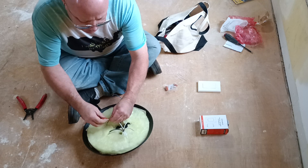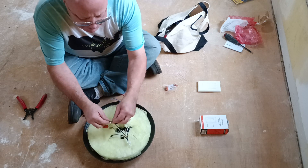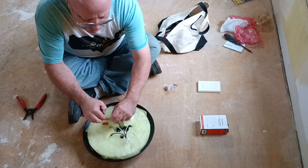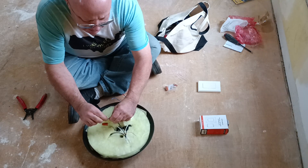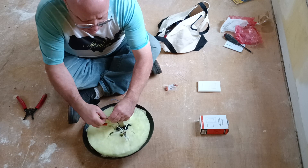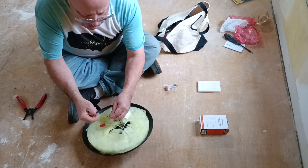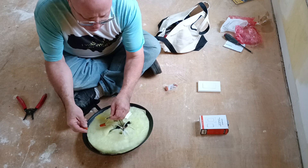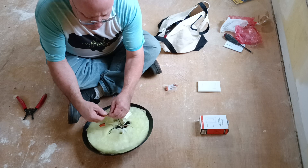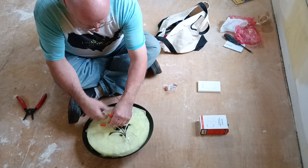I feel the spring grabbing the wires and it's nice and snug. We'll do the black wire the same — get our insulation even at the bottom, twist them together like this, bring them together, nice and clean. Get our insulation even at the bottom and our strands even at the top. Put this on here — it's snug.